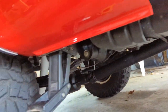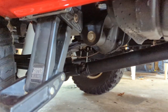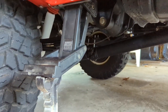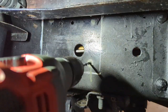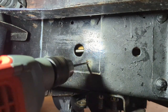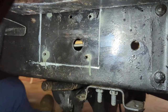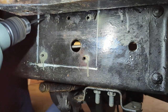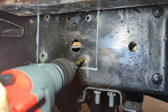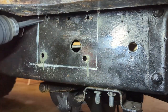With these all ready to go, I'm going to mark the location of the holes on the frame using some spray paint and then come back and drill the holes. I had some self-etching primer sitting around, so I marked the center of each of the holes on my braces and came through and drilled a small pilot hole first. My light falls about 20 times during this recording, so don't pay attention to that. Pretty much I stepped the size of those holes up until I got to the three-eighths hole that I needed to install my bolts.